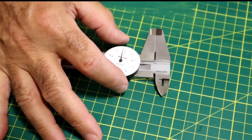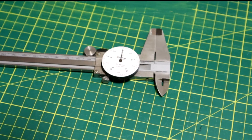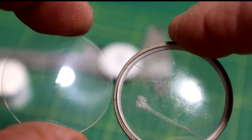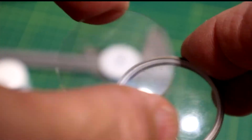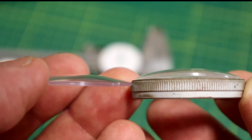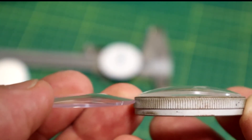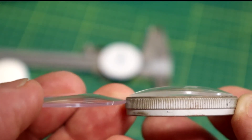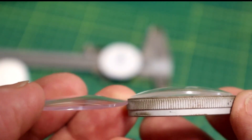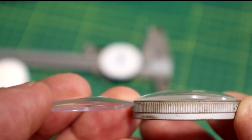This is the face, which I'll leave there because you'd have to take off the needle. There's the replacement lens that will go into the bezel. The replacement lens has a slight concave, but the lens installed in the bezel is more pronounced — because I have to press it in, and as it fits into the smaller diameter bezel the lens pops out further, which is why I have to compress it.